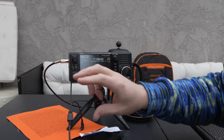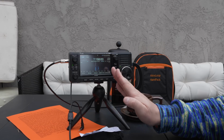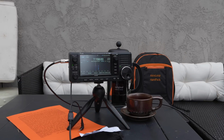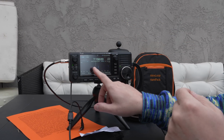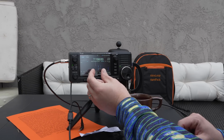It's just a slight turn, just using my finger to push the wheel a little bit, and you can watch the noise come over, and there you go, now we're resonant on that frequency. Let's flip it over to 20 meters, and I'll show you. So note the noise, the size, right? There's a high Q antenna, right? And we've talked about that in the past.